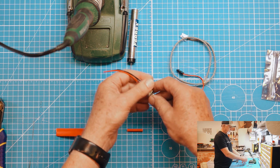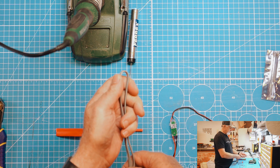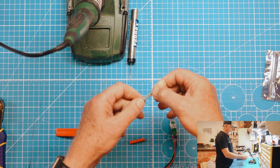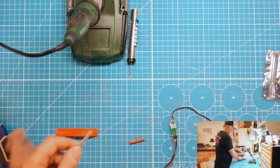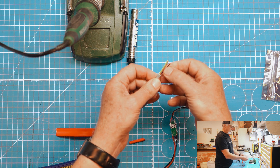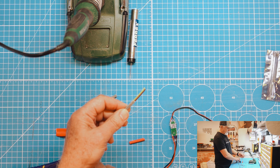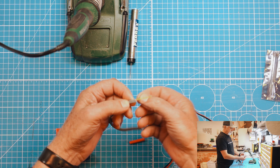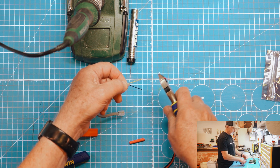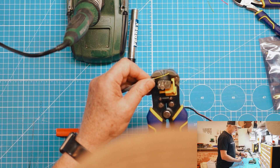Finally, we have bought this in the UK from a supplier of Raspberry Pi equipment. What this thing does is you pass in 12 volts on this side and it comes out as 5 volts on the other side — very simple, two wires positive and negative in, and 5 volts positive and negative out. First thing we're going to do is take the cable, cut it roughly halfway, put one half away for a rainy day, and that leaves you with this half. We strip a big chunk of the outer jacket, and we have four wires — we are only interested in the two outside wires, the yellow and the black. The red and the green we are simply going to cut away.